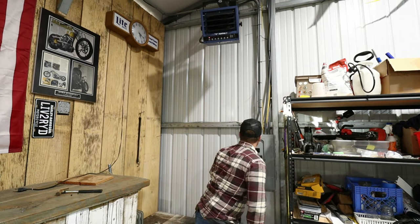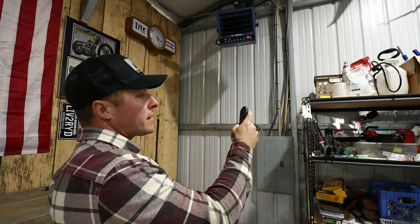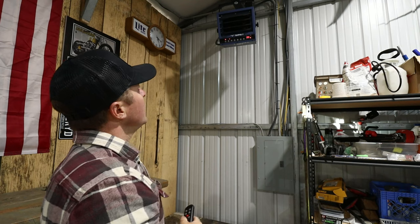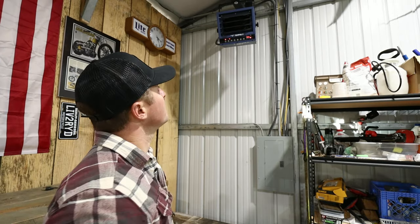Everything is good to go — that was a pretty straightforward and easy install. Now all we have to do is flip the breaker, make sure we have power and that we installed the wiring correctly, and then we'll get some thermometers in here and see how fast it can raise the temperature in the shop. We got power, I just heard it beep. It switches from high to low mode — we'll keep it on high. We'll set the temperature to 80 degrees. It says it is 41 degrees in the shop. There are two temperature probes: one for incoming air reading 41 degrees, and one inside that will bring it up to 80. When those two numbers meet, the unit will shut off.